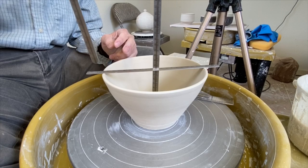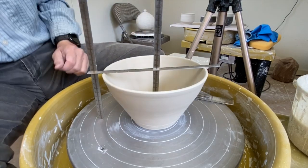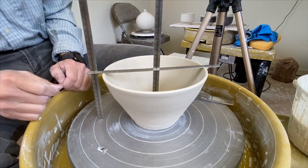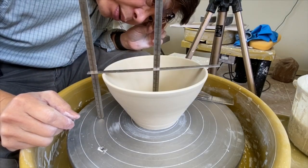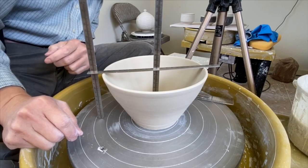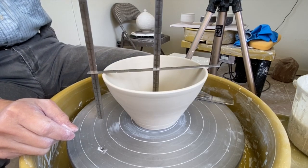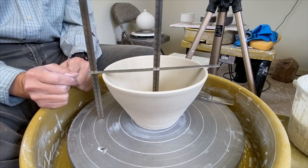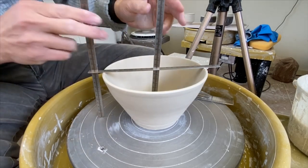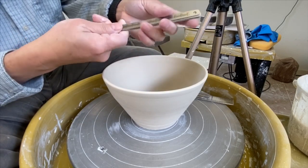So that's if you want to get an easier, instant reading, you could have a three-piece set. Okay, so let me check the reading here. On the outside is 115, and on the inside is 102. Okay, so 115 and 102, it comes to about 13 millimeters. Okay, 13 millimeters. It's a little bit less than half of an inch. So that's the reading. Exactly, you can get it right away. So that's the three-piece set, or we can use the two-piece set. Okay, 115 minus 102 is 13.